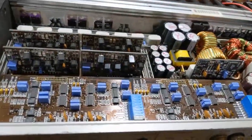Before I do that, the other thing I want to do is clean these switches, because these are also a common problem. What ends up happening is they get real noisy, and when they start to fail you'll notice intermittent audio or distorted audio. And if you wiggle the switches, it'll just pop in and out. So I've got to clean all these switches. I can clean the potentiometers too, but that would be a pain — look how many of them there are. More importantly, I need to clean the switches.